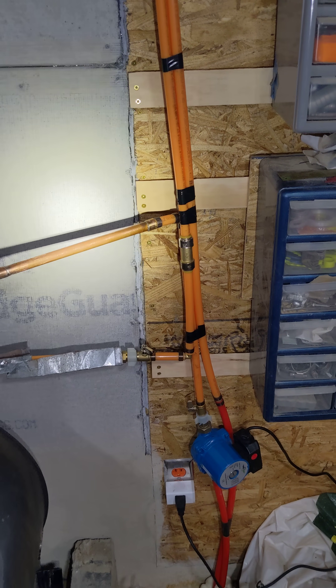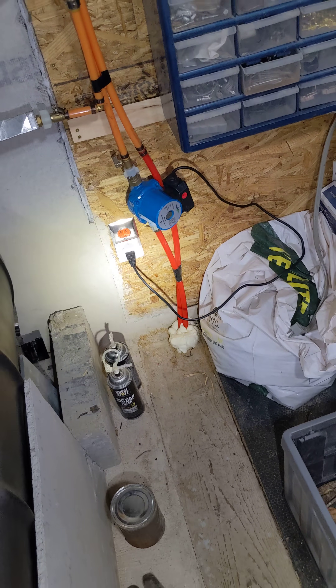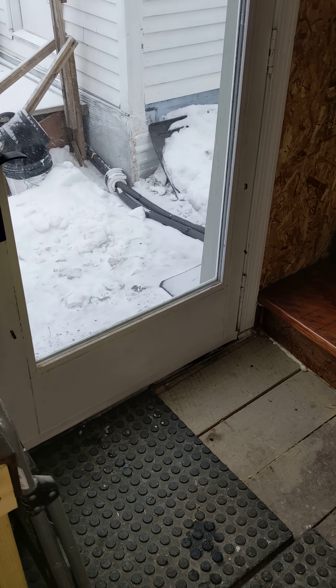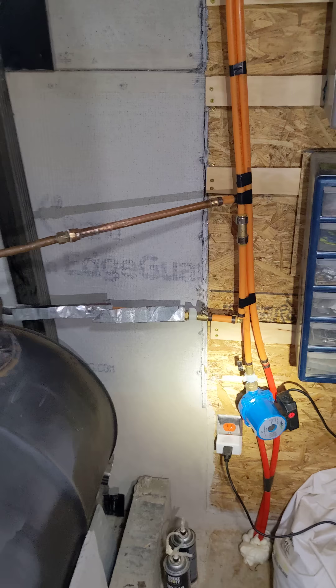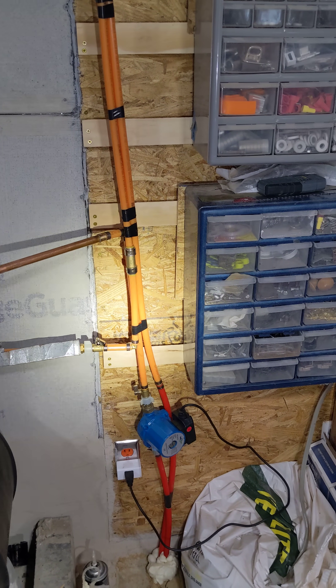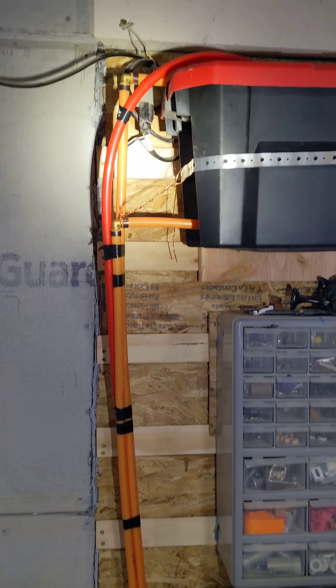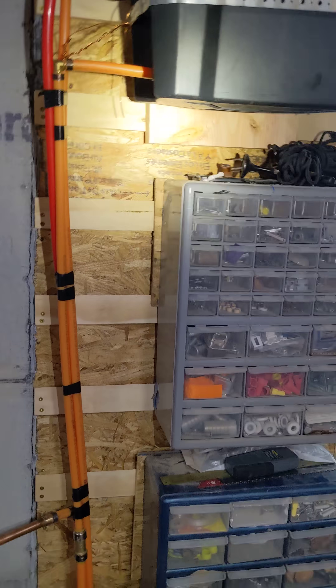Ignoring that red line, we've got a T, and then it goes down to where this pump is right now. From there it goes down into a feeder line that travels about 50 feet — it's underneath the floor here, a double insulated line — goes out underneath the steps and into the side building. Then it goes down underneath the floor over there and hits a heat transfer block so that it doesn't mix with the liquid I'm using for the floor heat on the other side. The water then travels back up and goes up to that orange line and over, and direct dumps into the top — so it's basically a closed loop system.